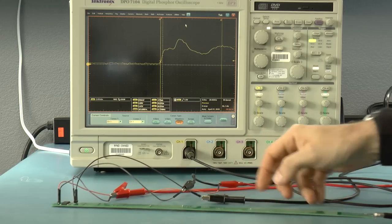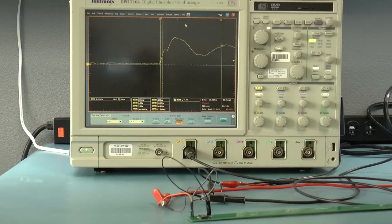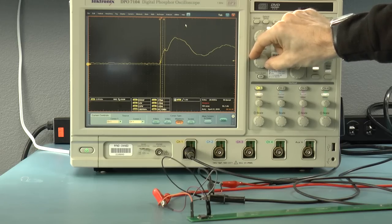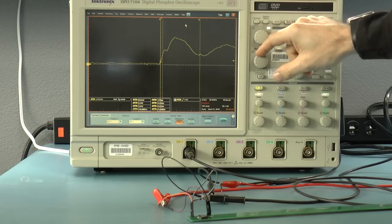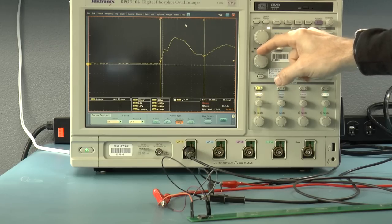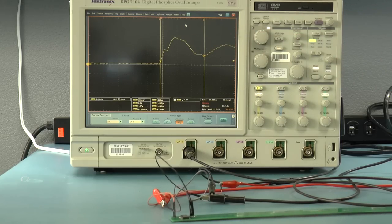Let's take a look at what happens two-thirds down the line. That's pretty bad. It starts at zero, rapidly goes up to 3.2 volts, bounces a little bit, and then goes up to 5.8 volts. Then it slowly drifts down to about 2.2 volts, then down to about 2 volts, then goes up to 4.4 volts. This is the interesting thing: this is 2 volts, which is just about the high threshold. If it had gone below 2 volts, or if there's a little bit of noise on the line, I could see a case where we might get double clocking.